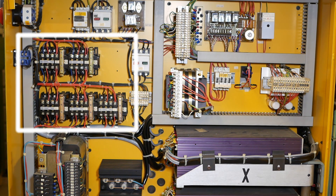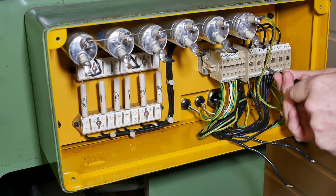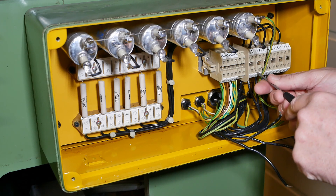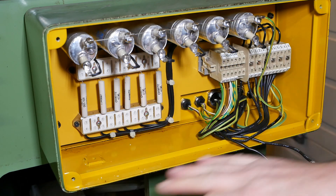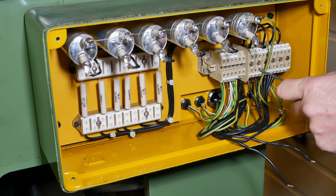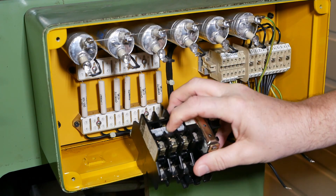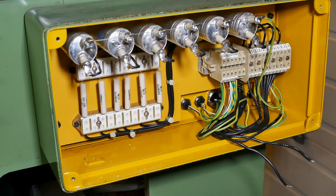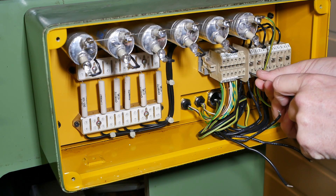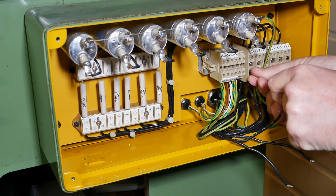I'm quite tempted to get a three kilowatt inverter, because that way I could connect up the motor directly to the inverter, removing all of this filter gear, removing four of the five big contactors and just keeping one as an e-stop contactor. I'm pretty sure a single VFD is going to be less bulk than five of those contactors.